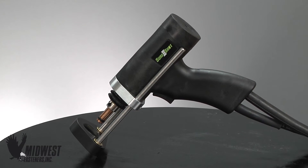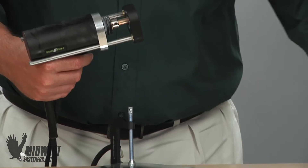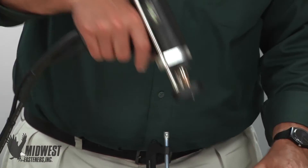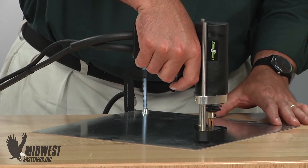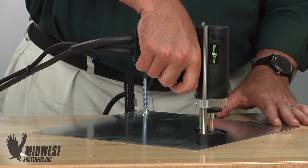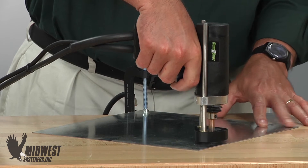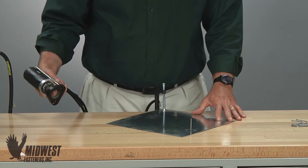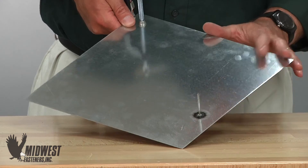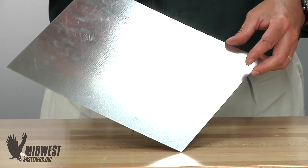With the gun prepared for the fastener to be welded, the fastener is held in the gun and everything is properly adjusted. The fastener makes contact with the surface to be welded as the operator locates the weld gun flat to the surface. Pressure is applied and the CD gun is triggered. The CD equipment completes the weld, and the welded part shows no backside distortion or burn through.